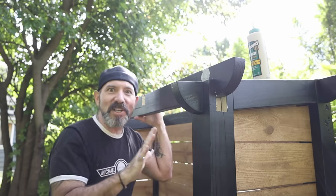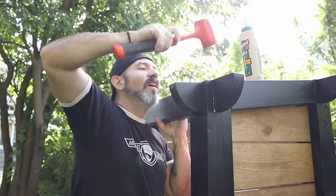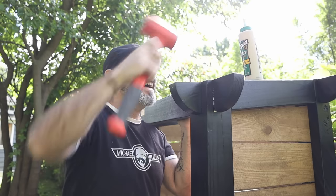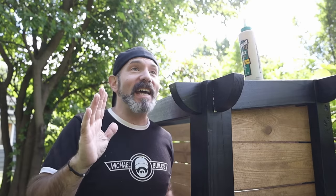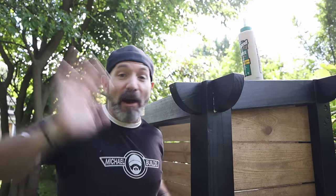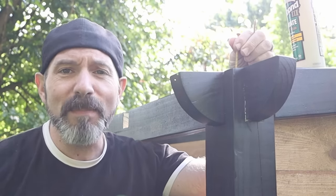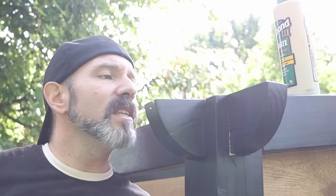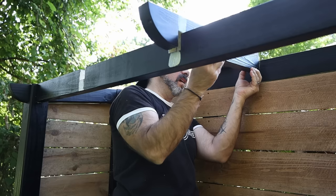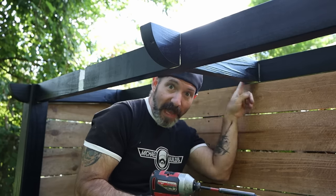Here's the money shot right here — that's satisfying. Dusty LumberCo, eat your heart out. By the way, this morning I uploaded my best Dusty LumberCo impression short, and within about 10 minutes Dusty actually commented on my Instagram short. I was blown away — I did not think he was going to see it, let alone comment on it. So thanks Dusty, you're the man! I don't need to put a screw in here, but I'm going to screw this 3-inch decking screw right to the center of this joint just for funsies. Middle braces are getting 2½-inch screws pocket-held in the back so that the screw doesn't blow out the back.